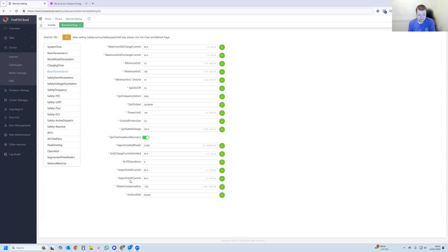You can set your import and export limits. The export limit is set in watts — how many watts of concurrent power you're trying to limit yourself to — going right up to 30,000 watts (30 kW). You can also set your export limit in amps. These settings are probably being added partly to comply with new G99 requirements.